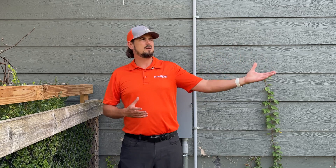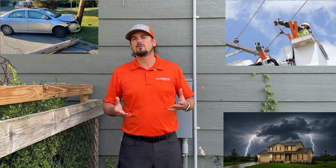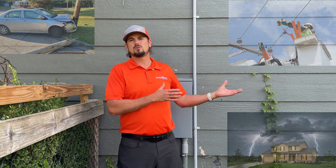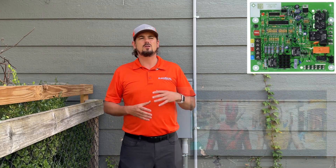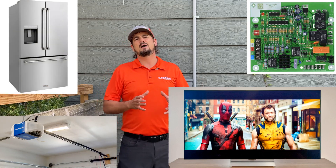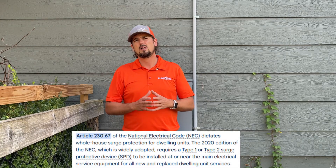Why do we want it? It can save you a lot of money when you have surges from things like lightning storms. We have power poles where maybe a driver ran into a pole, or maybe they're cutting the line while they're working out there — that can send surges to your house. You also have surges from inside your house when things like your microwave, your oven, your dryer — big loads — get turned on and send quite a voltage spike through your devices. Those devices with critical circuits in them, like your TV, garage door opener, and refrigerator, are not made to handle those large surges. So in 2020, the National Electric Code made it a law that you need a whole house surge protection device in your panel. Today, we're going to show you how to do that.